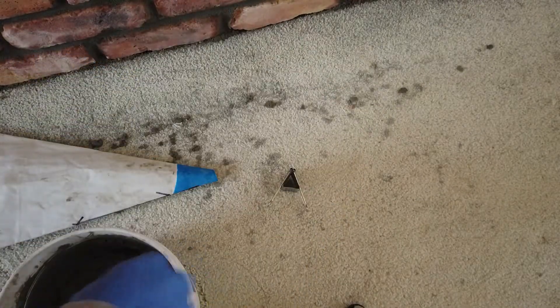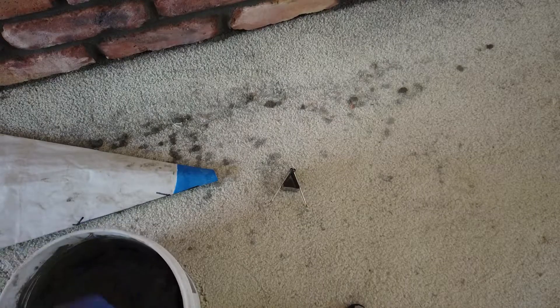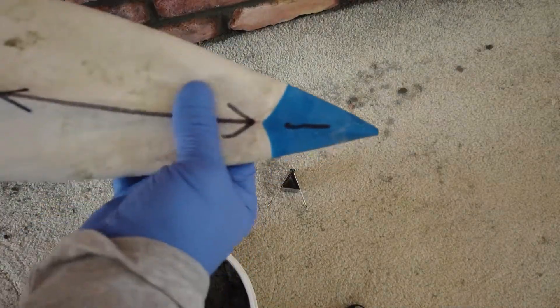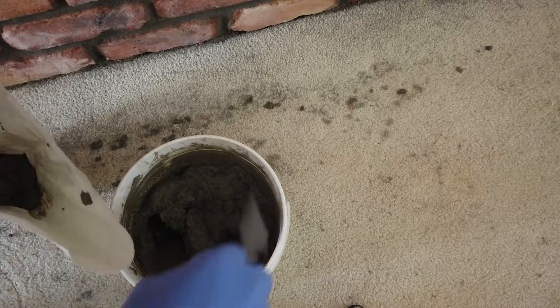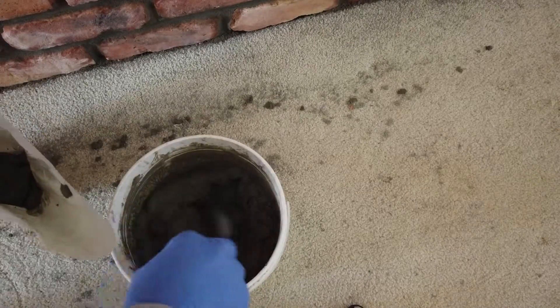This batch represents my pace in terms of quantity per mix. I put an arrow on the bag so I know where my 40-to-45-degree angle is so I can squeeze easily — once you start twisting and filling the bag it gets disoriented very quickly. I also put a clip on the end so that when I'm filling it, the mortar doesn't all come out.